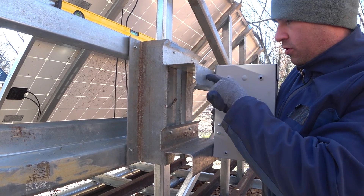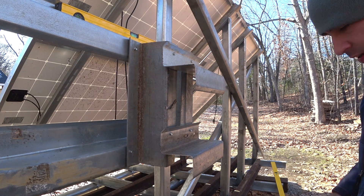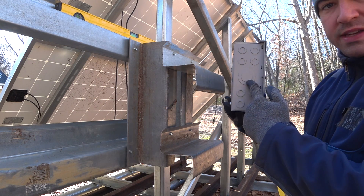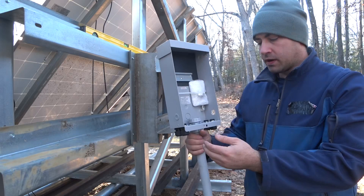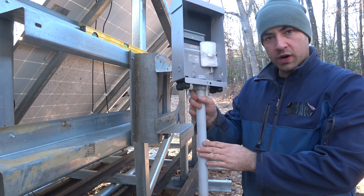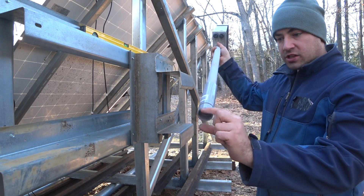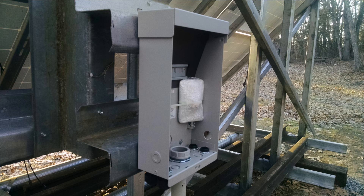As you can see, the screw holes will line up with the Z-channel. I went ahead and put the strain reliefs in along with this adapter — it's for a one-and-a-quarter inch hole, but I'm using one inch conduit. I also attached the expansion fitting down here. The box screwed on using the same self-drilling sheet metal screws, and it lined up well and looks great.